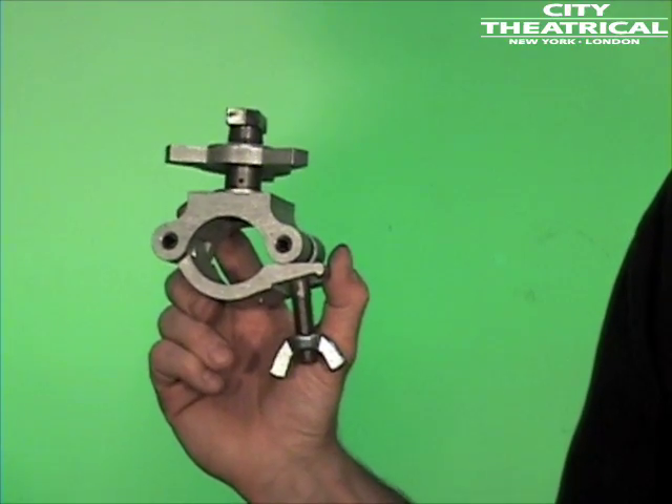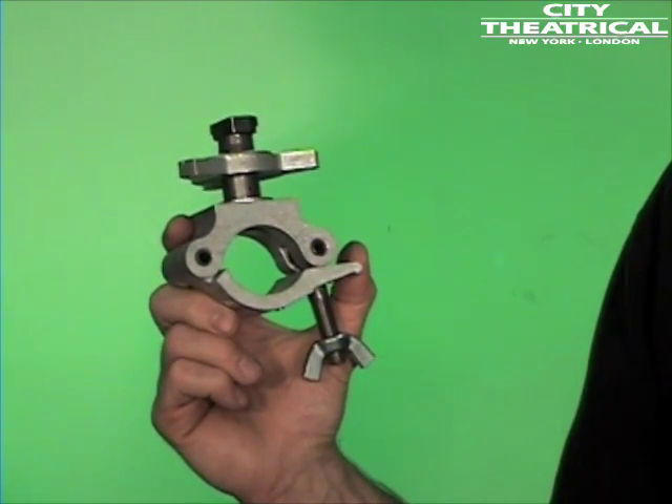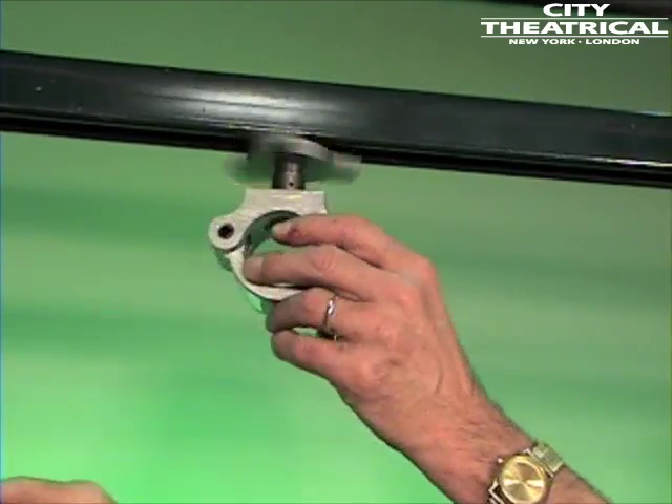The number 523 track tamer with aluminum split coupler allows you to hang a piece of inch-and-a-half ID pipe or 2-inch OD aluminum tubing from Unistrut. Again, it has a knob so you can tighten it down by hand, and a hitch pin to keep it from loosening.